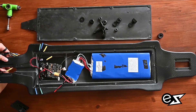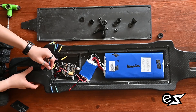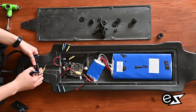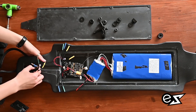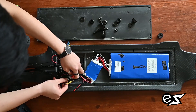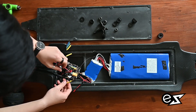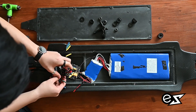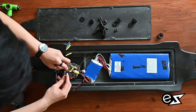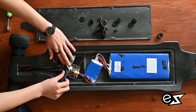After you've done the motors and the trucks, you feed the cable of the motor into the hole as shown in the video. Then you can start plugging everything in, including the sensor cables and the cables on this side. I usually like to keep the colors the same, and make sure you connect the left side of the motor with the left side of the controller, or it won't work.